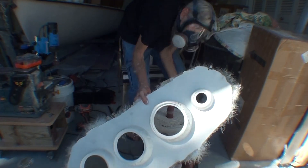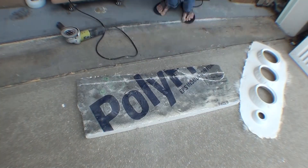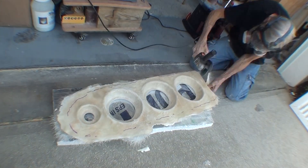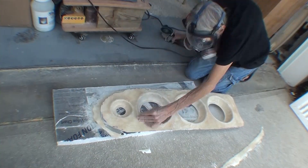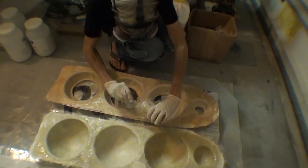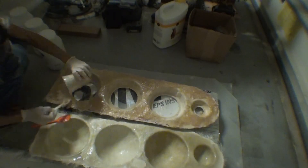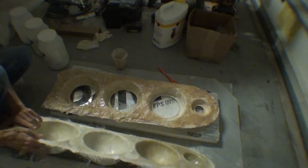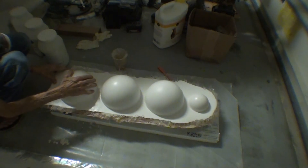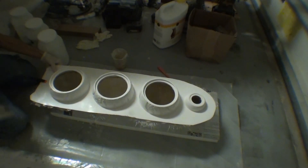There are different size spindles for sanding different size holes. Now I'm making the back side of each of these as flat as I can in preparation for gluing the two together. I'm also cutting them to approximately the same size so my clamps will fit easier. This is just thickened polyester resin that's been catalyzed — I pile a whole bunch on and then try to line up the front and back halves before clamping it down.